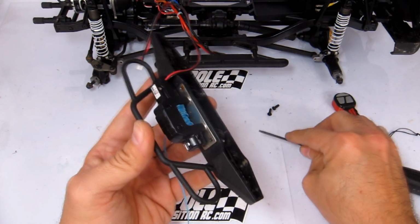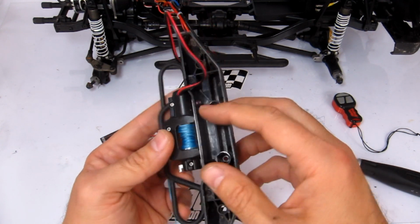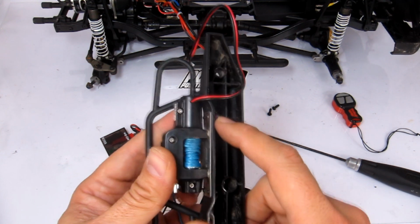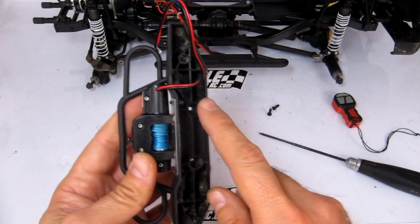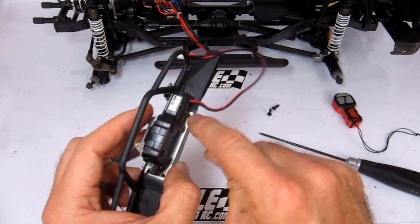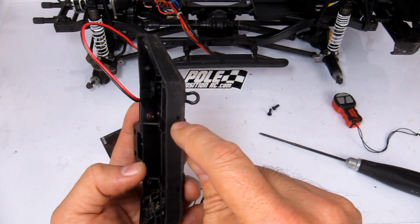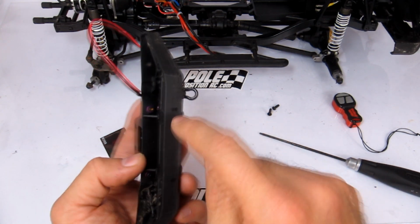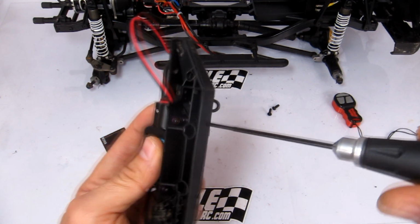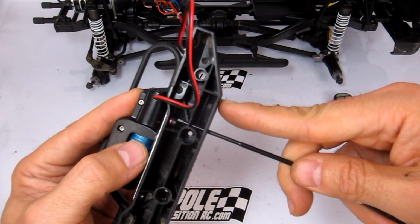And then took, I think it was a 2mm, yeah, because I think these are M2 screws, maybe M2.5, I'm not sure. But took a 2mm drill and just made the holes through there, and then followed through, marked the holes so that we can access from the bottom, just in through like so, so that we can attach the front screws.